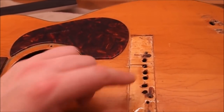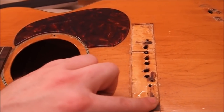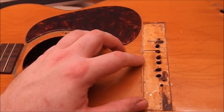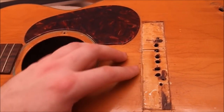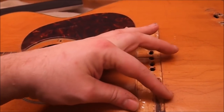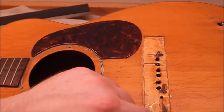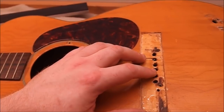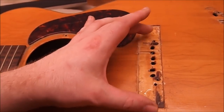I'll get in there and plug up each of the string holes, take a router, cut off the offending epoxy. I'm not going to try to scrape back the remnants of rosewood. I'll make a new bridge that overhangs the outline by about a 32nd of an inch — not for cosmetic effect, but because I'm going to inlay a piece of spruce on top to build it back up, and I want the bridge to be slightly wider than that. There's a stress line right at the back of the bridge. Inlaying spruce from the back side isn't feasible on this guitar, so I'll do it from the top.